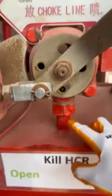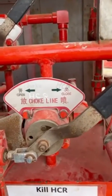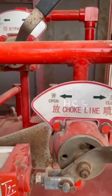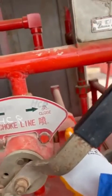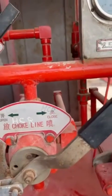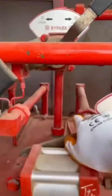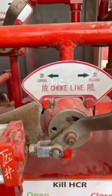When the handle is on the closed position, the oil will be directed from the manifold by high pressure. It goes to the closing chamber through this way, and the oil which is already in the opening chamber will return from this line to the oil tank.